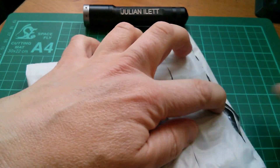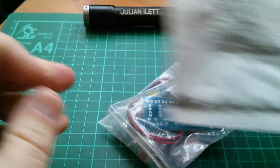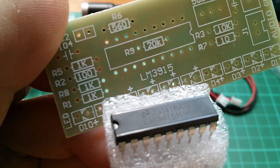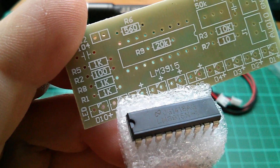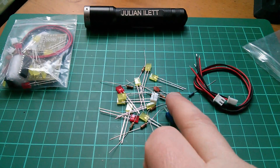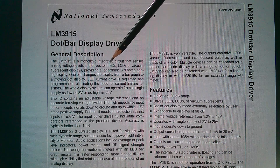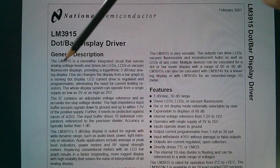Next up is this — from China. It's two little kits containing LEDs and a 16 or 18 pin chip. The chip is the LM3915 — you can see it printed on the silk screen of the circuit board. This is an LED bar graph VU meter on a logarithmic scale, and also included in the kit you get all these yellow and red LEDs. According to the datasheet, it's a monolithic integrated circuit that senses analog voltage levels and drives 10 LEDs, LCDs, or vacuum fluorescent displays providing a logarithmic, 3 dB per step analog display.